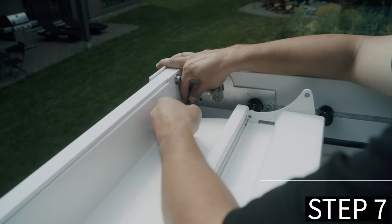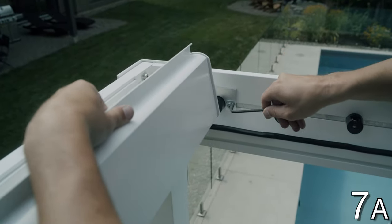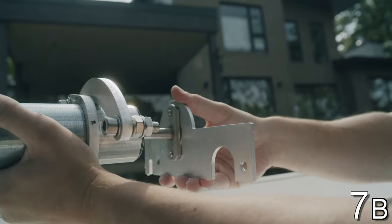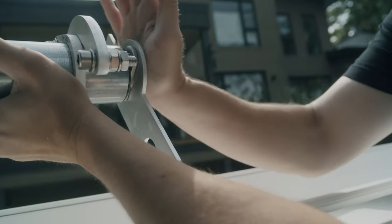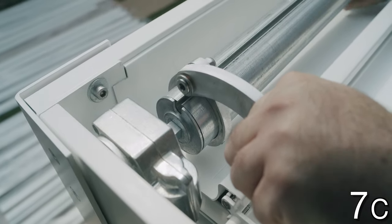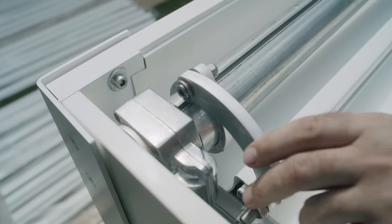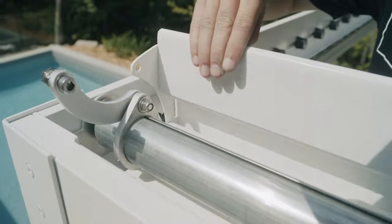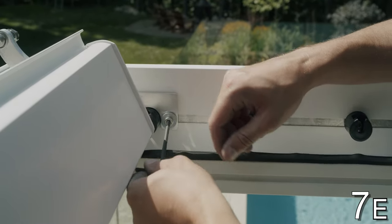Step 7: Assembly of the rolling tube. Remove the FUM73 by unscrewing the B screw and sliding the FUM73 up. At the opposite extremity of the square pin, insert FUM73 inside the maneuvering tube. Starting by the gearbox side, align the end of the maneuvering tube with the square pin and insert it inside the gearbox. Lower the entire tube over the tray. Ensure that the plate is laying over the last plastic clip receiving the blade. Screw tightly the B screw to keep the FUM73 in place.